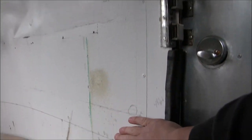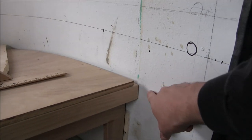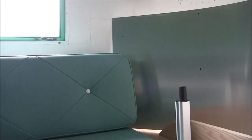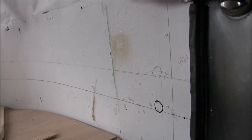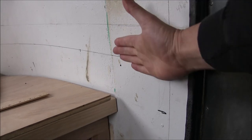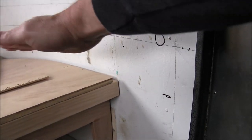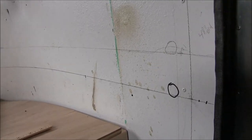I'm going to overlay this panel right even with the top of the sofa. The cushion sits up here so you're not going to see the seam. You'll see a little bit of a seam here, but if you look throughout the whole trailer there are seams everywhere, so it's going to match in pretty good. On the opposite side of the trailer there's a backrest cushion so you wouldn't be able to see how unproportioned it is. I measured down from this line here 24 inches. I'm going to take this panel away, leave this lip intact, the new panel is going to lay on top, and then I'm going to rivet it all the way across the bottom.